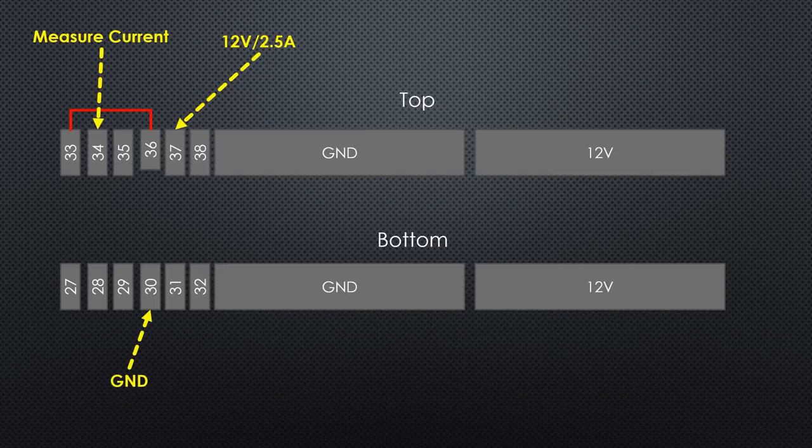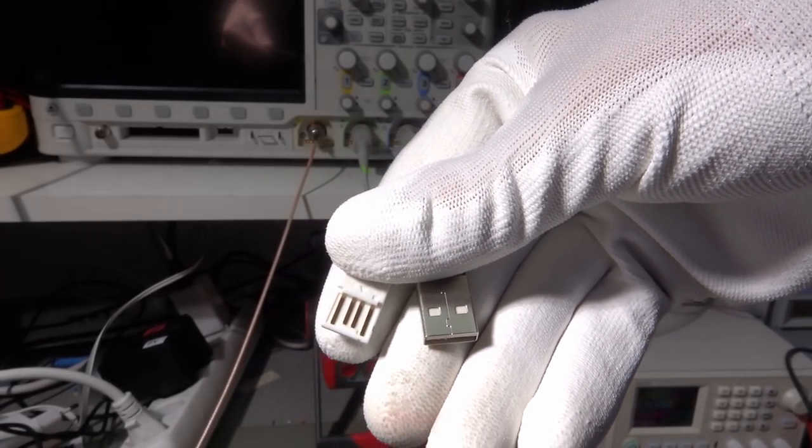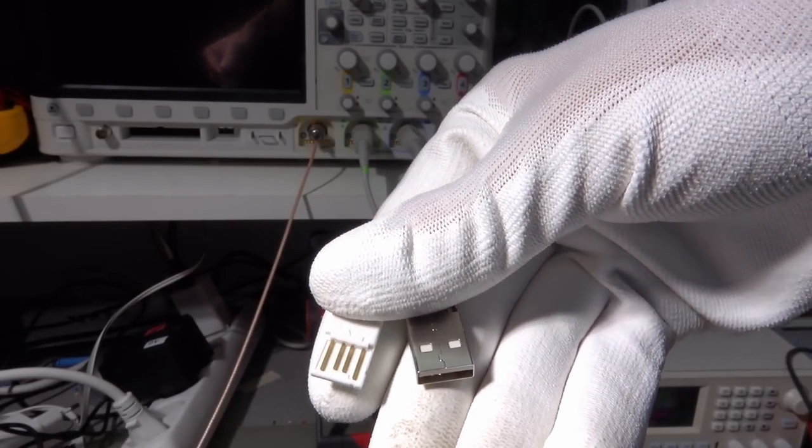Pin 30 is also ground, and pins 31 and 32 are I2C signals for the PM bus. Pin 35 is a 3.3V status signal — it is high when the PSU is on. By the way, on pin 36 we see a smart concept: this pin is a little shorter than the others, so it connects later than the other contacts and disconnects earlier. You find this concept also in USB plugs where they want stable power before connecting the data lines. Brilliant!